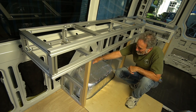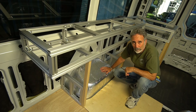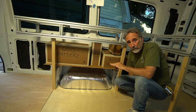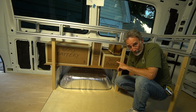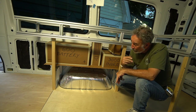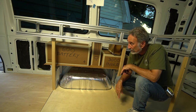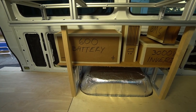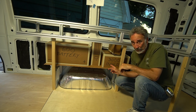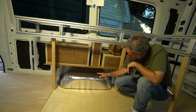This is the battery compartment — it's going to house a 600 amp hour lithium battery. These are scale models, exact sizes but not exact weights. So this is the 600 amp hour lithium battery — one big battery, a mama of a unit. Combined with this 3000 watt inverter charger that's going to run this whole shebang, plus a solar controller and a battery management system. Got a lot of room down here.